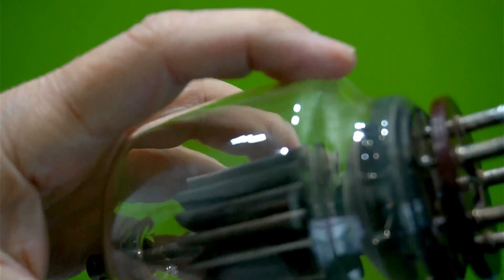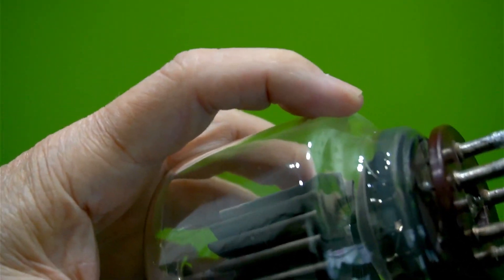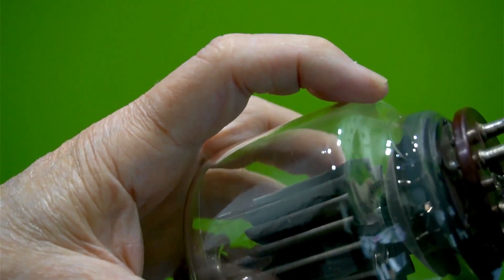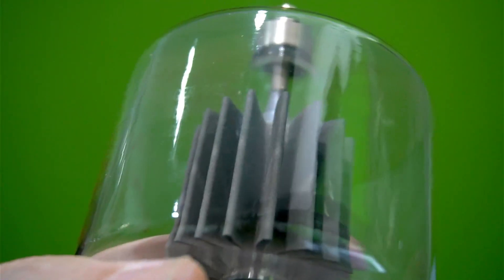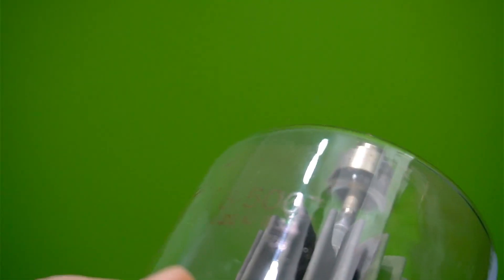There's the tube that's filled and you can see the crack that occurred. It occurred at one of the filament pins, right to the pin. The solder at one point had leaked out. I attempted to re-solder it, probably didn't do a very good job. The code date on the tube is 1977, 15th week — 77, 15 is the code date.